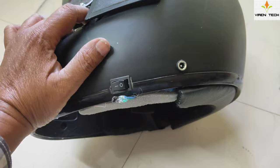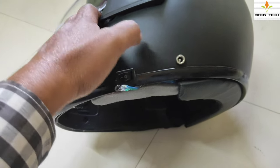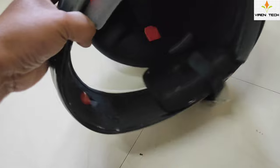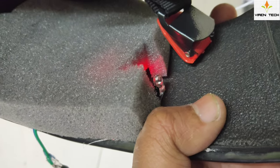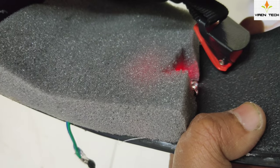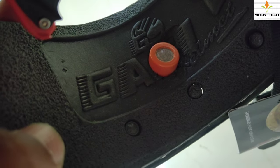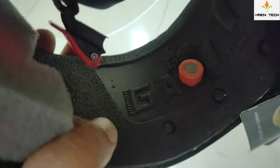For that purpose we have developed some circuitry and inserted it into the helmet. There is an on/off switch to turn the helmet transmitter circuit on and off, and a recharging socket to recharge the batteries inside. The helmet is equipped with a sensor that will detect the presence of a head inside it. There is also an alcohol sensor on the front side — if the user has drunk alcohol, the sensor will detect that and immediately send a signal via the transmitter.